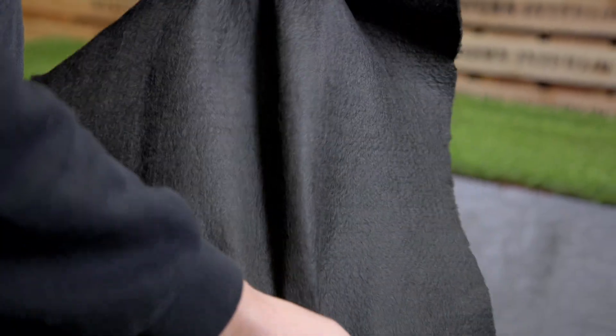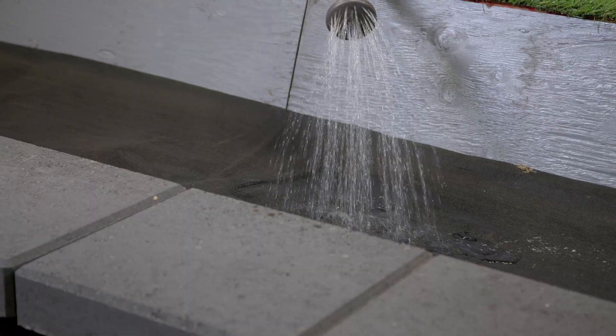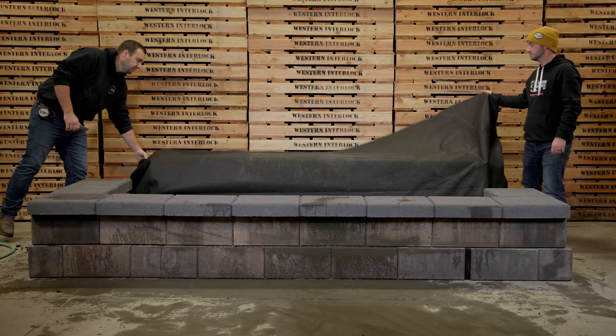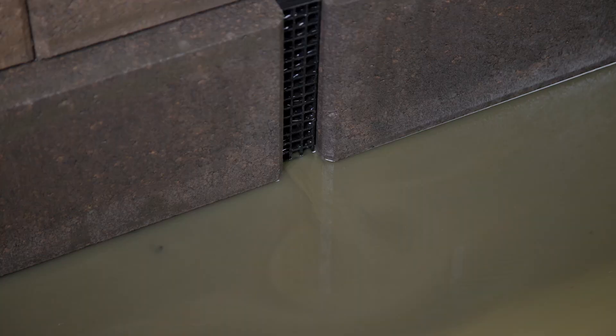The final component for retaining wall drainage is a piece of geotextile. There are various different kinds, and what we want to see behind the retaining wall system is non-woven, which means it has permeability to it — it's basically like a thick landscape fabric. What this does is it keeps soil from migrating into your gravel backfill. Soil that gets into your gravel backfill can expand and contract through freeze-thaw cycles, clogging up your drain rock and worsening your retaining wall drainage. What you would do is lay this on top of your compacted gravel base, wrap it up the back of your wall and over the top of your gravel backfill, so that all the water that gets into your gravel backfill is clean — no dirt in there — and it gets out of your system quickly.